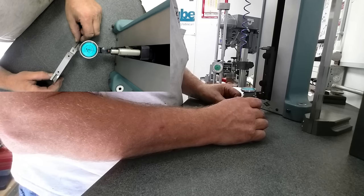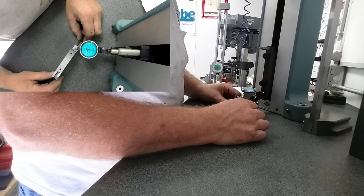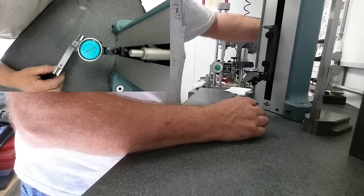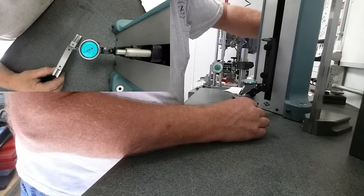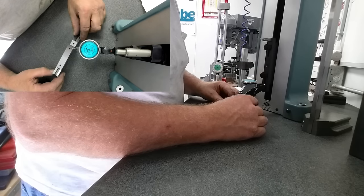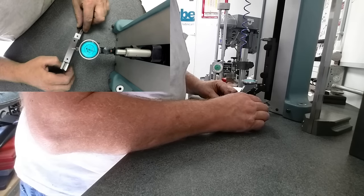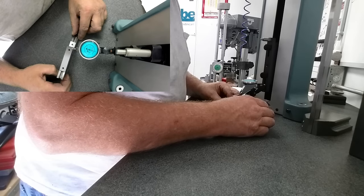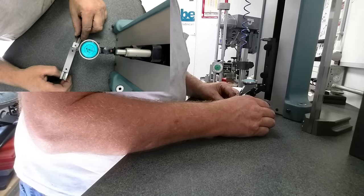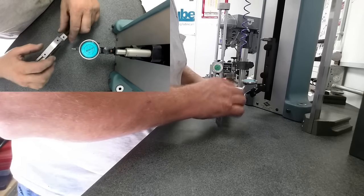Okay, we're a shade above zero — a shade below zero — so that's about a tenth total. Tenth above, right on zero, so within a tenth. Pretty happy there. And then come here — same thing. Zip around and see if we got those same ones. This was our very first grind here — same thing. We're about a tenth side to side. Tenth side to side.